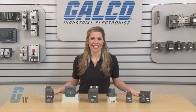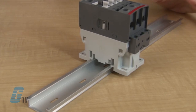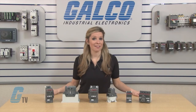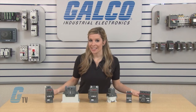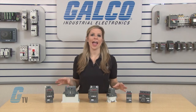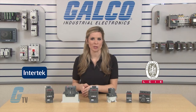Lines from the AF09 to AF96 can be installed and removed from a DIN rail without any special tools. The ABB AF contactors from AF09 to AF96 and AF400 to AF2650, and all NF controlled relays, have been third party safety certified and are certified to be used in safety circuits.